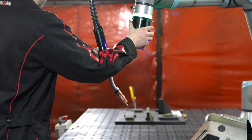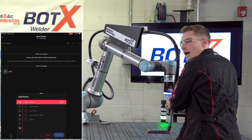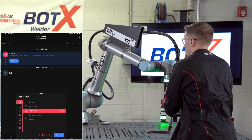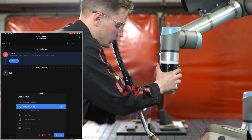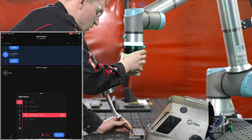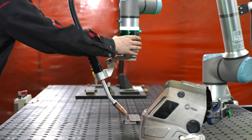On this part we're going to first program a tack weld. We're going to start by moving the robot into the position of where I want the tack to be, then tap and save this location as a tack. We're going to move the robot back into an air motion and save this position. Now we're going to drive into where I want this linear stitch weld to start. We're setting up our torch angle to be at 45 degrees into the root of the weld, also pushing our wire.